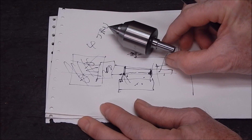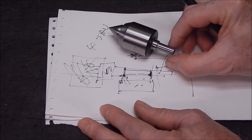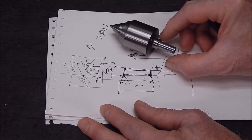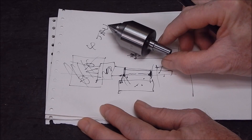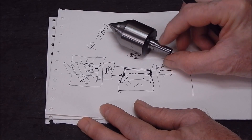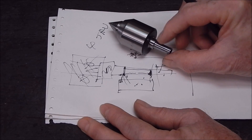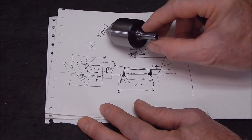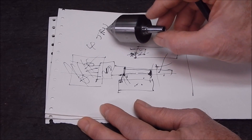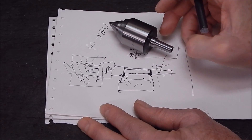You can either do this with a grinder or with a cutter. I was going to grind this originally, but then used a cutter because you only really need a grinder if the metal is super hard. Even though these are hardened metal, it's still machinable with high-speed steel if you take light cuts and go slowly with cutting fluid on it. Then just go with a bit of wet and dry emery at the end with a bit of kerosene and you get a nice finish. It turned out very well.